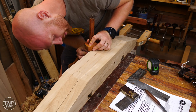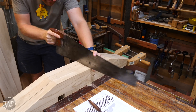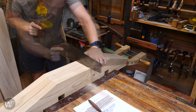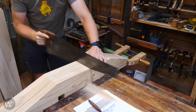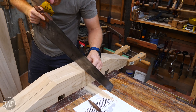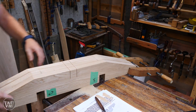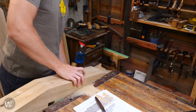Once I get those depth marks, we can grab a saw. For this I'm going to be using a panel saw with cross-cut teeth — a bigger saw makes cutting through this much material a little bit easier. I could use my carcass saw, but this saw is actually really nice. I'll cut one side and then the other all the way down on my side of the board so I can follow the line. Then with the vise I can pick it up, flip it around, and cut from the other side so I can always see the line I'm cutting on.